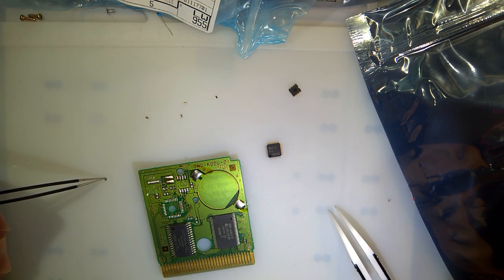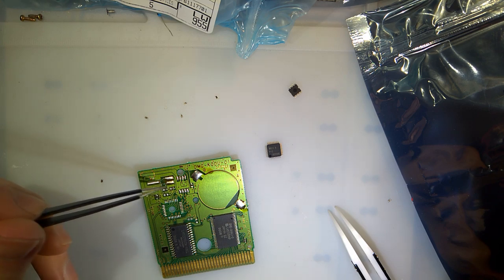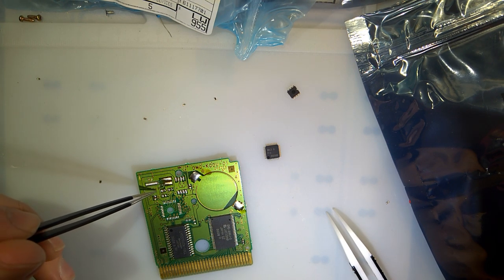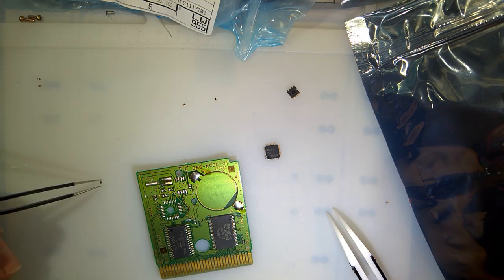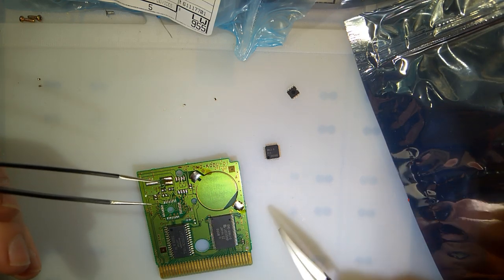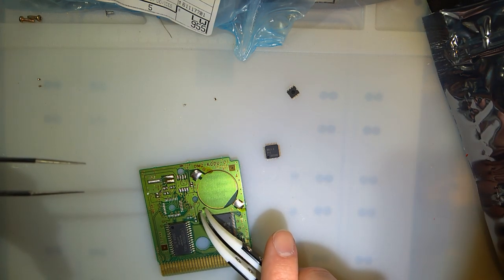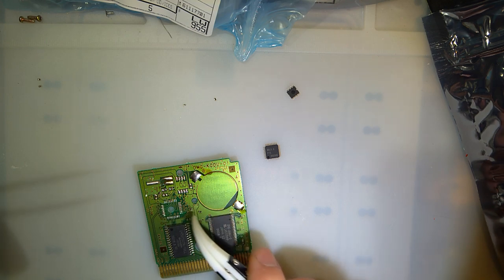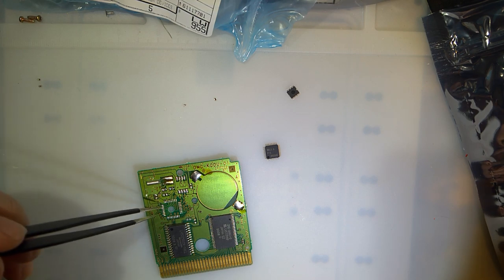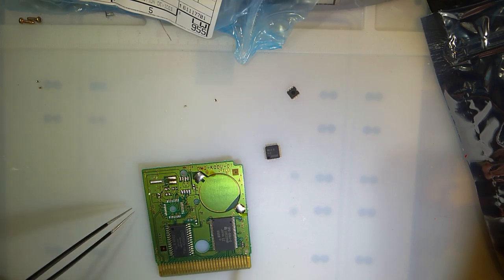I believe this is the capacitor that I need, C1, so that would be this one. I need these two capacitors, C1, not C4, but C2. These two capacitors, I'm sorry. And not this one. I also don't think I need this capacitor, or the other one that I accidentally blew away. Here it is. I don't think I need either of those two. Actually, all three of these should be 0.01 µF, and these two should be, I believe, 15 pF. So maybe I'll try reusing those. But otherwise, I'm going to let this cool down, let this heat bubble dissipate, and I'll be back in just a second.